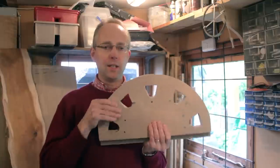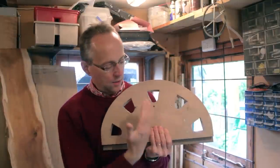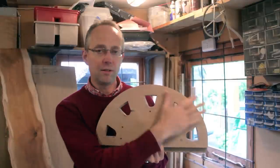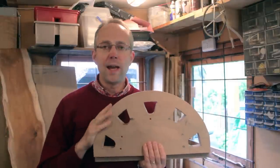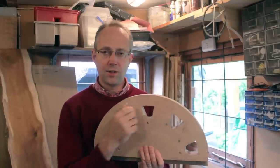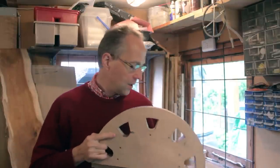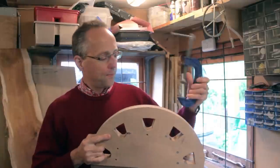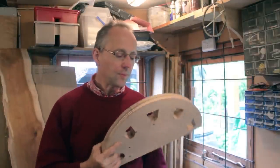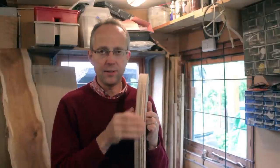I've been doing some work on the larger bow former — that's the back of the bow and the nine-inch radius bend. So this is a nine-inch radius on this, really a semicircle in effect. It's two layers of 18mm ply again. I've made these indents to take the G-clamps for actually clamping the steamed wood firmly to the former. You can see it's two layers — that's nice and thick.